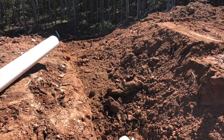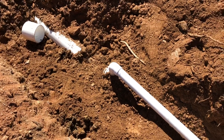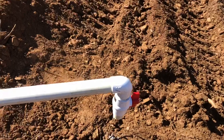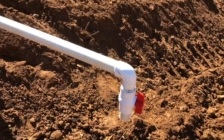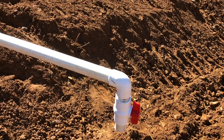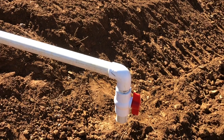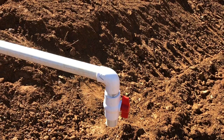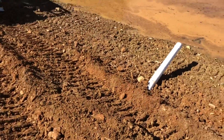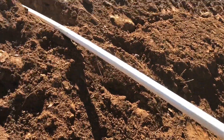We've gotten most of our trench filled back in to hold everything in place. Right here we have a T in the six-inch pipe reduced down to a two-inch pipe. It comes up, comes out, and goes back down on the end with a ball valve. This allows air in and out of the system. Once suction engages, the water will be above this point keeping it full. As the water level drops, it'll drop below this pipe, let air back in, and the siphon will release. The ball valve also lets you close it off so the siphon keeps draining the lake — basically a way to drain the lake if the owner ever wants to.